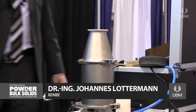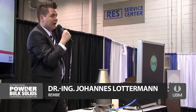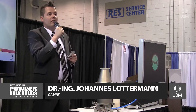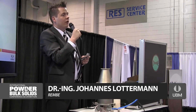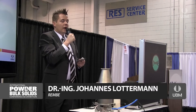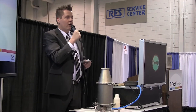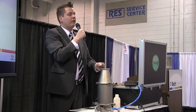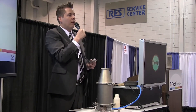The typical concept to protect installations where you have to consider explosions is to use explosion venting devices. Explosion venting devices are simply spoken predetermined bursting points of your installation — the weakest part of the entire installation — in order to allow pressure relief to a designated area. What I'm going to do is equip my explosion relief device on this test vessel and then carry out the explosion.